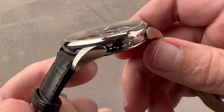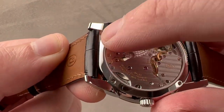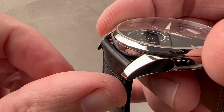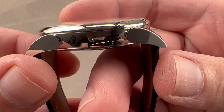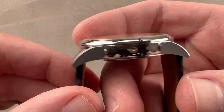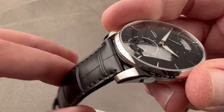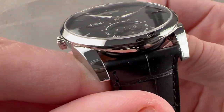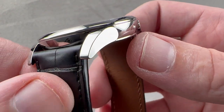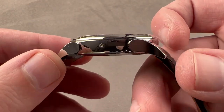Taking a quick look at the case, you can see that it features a little bit of a recess at its end — see how it's flatted out? That allows the lugs to be drilled exceptionally close to the case, which narrows the pivot centers between the lugs, allowing you to wear it on a smaller wrist, and allowing the strap, while being very close hauled to the case, to still move without any impediment. The lugs are sculpturally set out from the case — beautiful polished metallic teardrops that separate the vessel holding the movement and the dial from the ergonomic interface with the wrist.